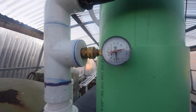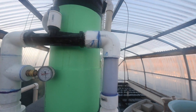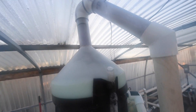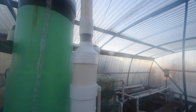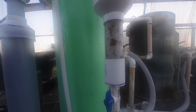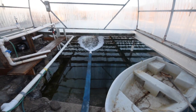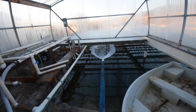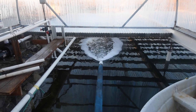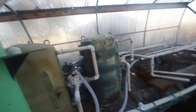Currently we're running at about 30 PSI. There's your main injector — that's the two-inch full foam through the stack — and you can see right here where the foam is coming up over the top, coming out right there and down through the overflow. You have all kinds of crud in there. For flow control we have a nice four-inch gate valve, and then the water outputs. One thing I didn't accommodate for in the design was just the sheer amount of turbulence inside of the main chamber. But that's the skimmer — it looks like it's working — and it's been quite an adventure. It's running right now at 40 PSI.